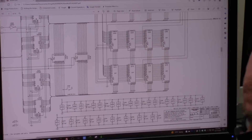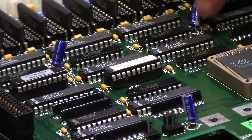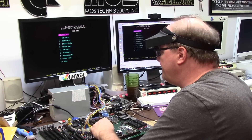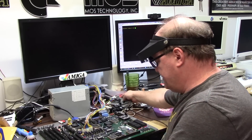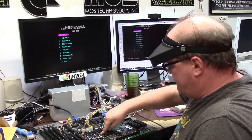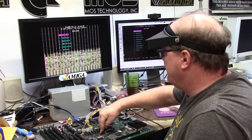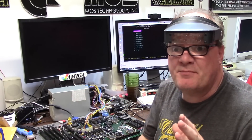I need to press down on each chip. 257 — bingo! Okay, I'm on to something. I was right. Now I'm going to repeat the same thing on 258. 258 — nothing. Pressing 253, buffer chip — nothing. 254, logic chip — nothing. 256? 256 is putting stress on 257 near it. Okay, I'm getting there. That is significant something. That's the old Edwards logic probe deal. We'll just start pressing on stuff and see what messes up. I was going to replace that guy anyway — just go in and replace them all. It's 30 years old, guys. Things happen. Chips burn out.